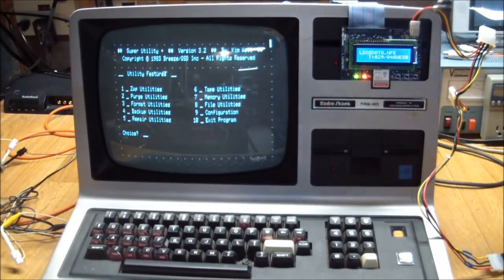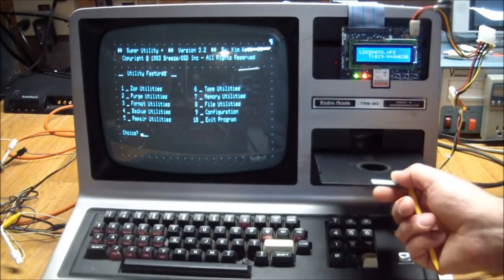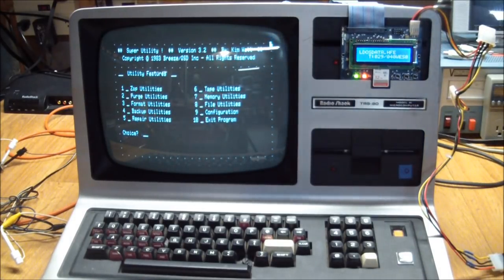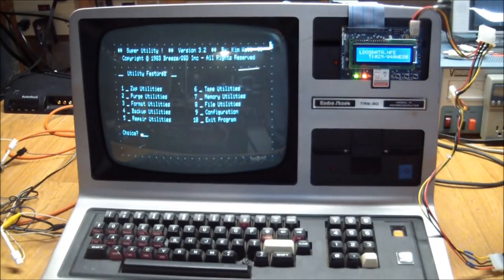The one thing that I alluded to and I haven't really talked about is, how did I originally make floppies for this? In order to actually make floppies for this, some software exists that you can run on an older PC and actually write the image on an older PC to a 360K PC drive, and it kind of works. I don't have a 360K drive yet. I created this disk using a 1.2 meg disk, and again, with all of the floppy issues that I complained about, it is kind of hit or miss using a high density floppy drive.